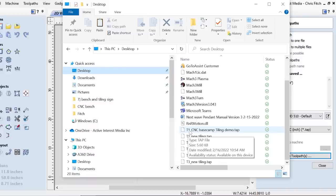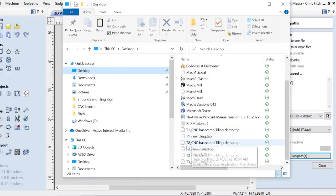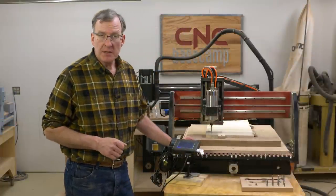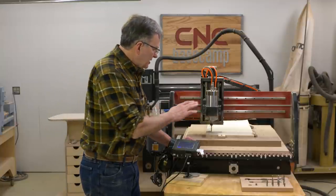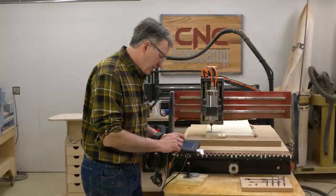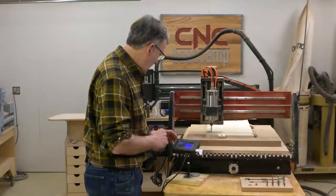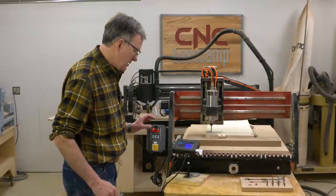The interesting thing is when we go to where that file was saved — in this case onto my desktop — the program created three independent files, one for each of the tiling sections: tile one, tile two, and tile three. Even though we've only saved once, the tile manager creates three independent files. When we get back to our router, we're going to run three separate files in order to create the tiling pattern and produce the crest rail. I've got everything set up for cutting our demo crest rail — a piece of plywood about 50-plus inches long by 11 inches wide, set up for the first pass. I'll choose the T1 tile file, turn on the spindle, and get started.